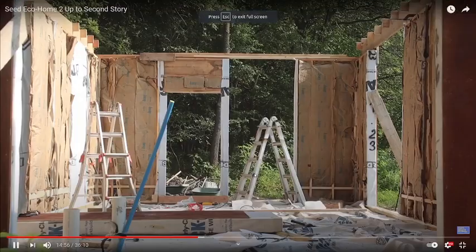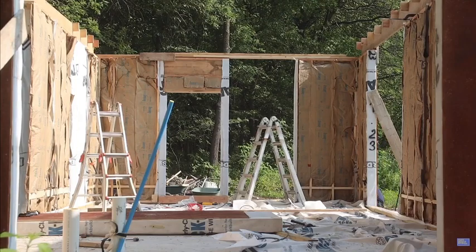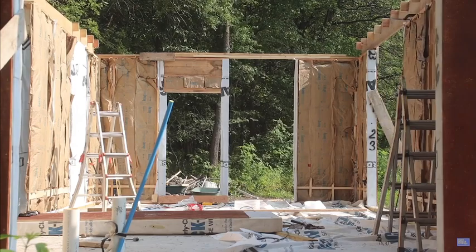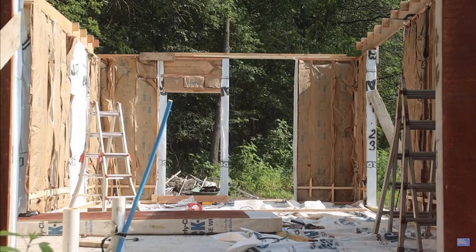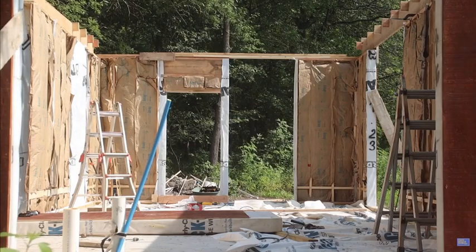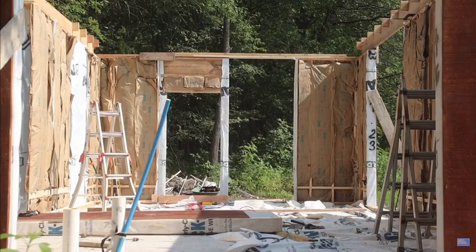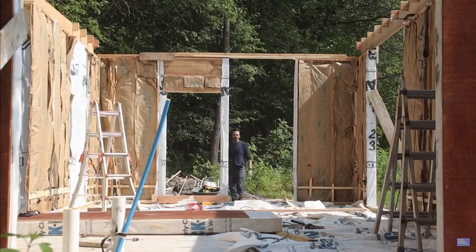Wow, guys, remember this? That was kind of scary. When I just look at this here without the rails and the self-alignment at the top, you're fighting every joint. And that's what took a lot of time. We had to put a scab everywhere. You're fighting getting through the insulation to make the connections. There's the house wrap that you're struggling with and a soft insulation outside. We eliminated by design a lot of this in the workflow. So now it's much more pleasant.